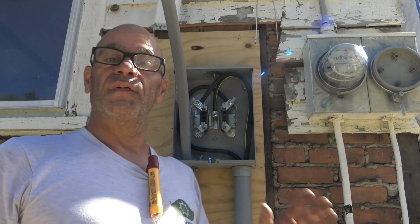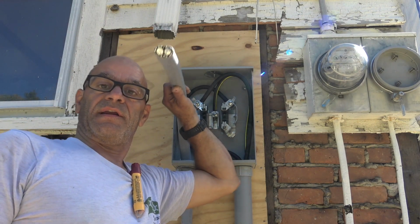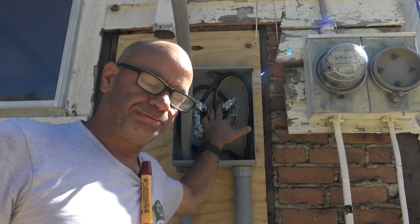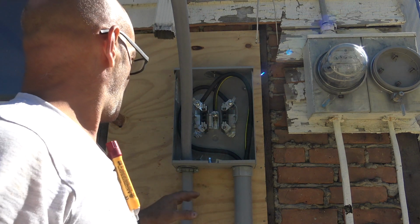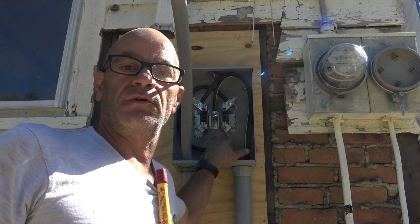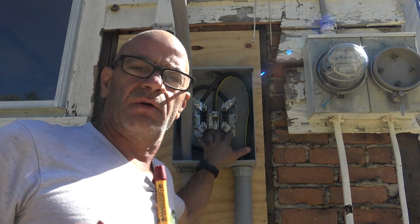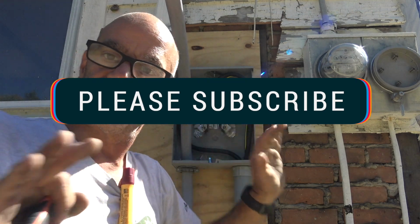Hey everyone, in this video I'm going to be connecting our wire, this big wire right here, going to our panel to our meter. I mean it's pretty simple. Going here, going there with our two hots. Which one goes where? Nobody cares. They're both 120, okay? Just like when I showed you to do the 220 volt outlet. Again, this is where it's coming from, so it doesn't matter.